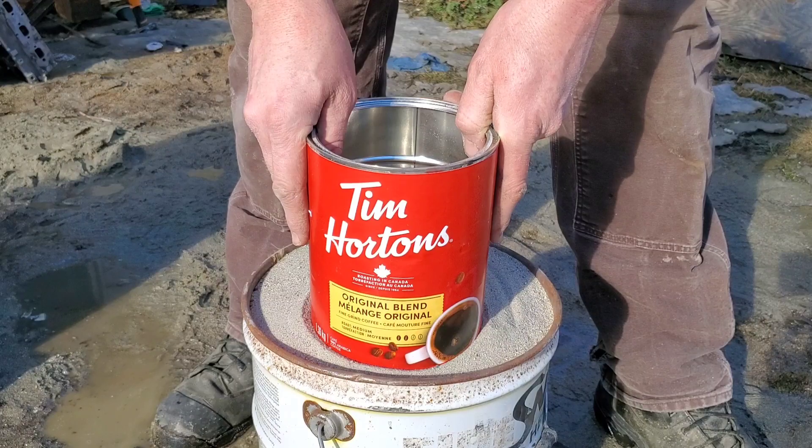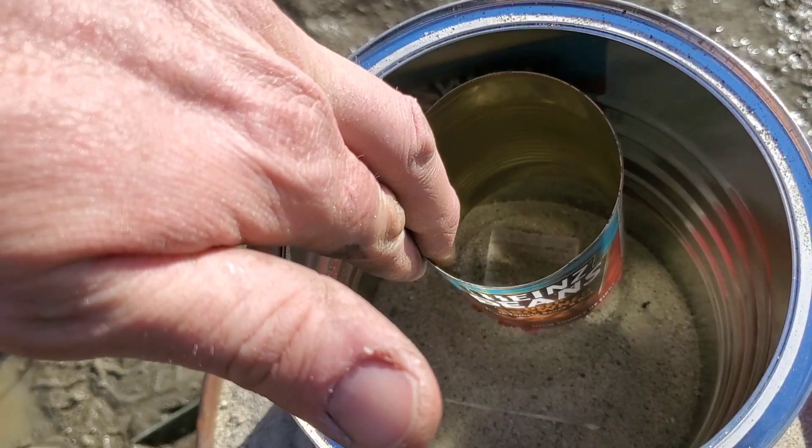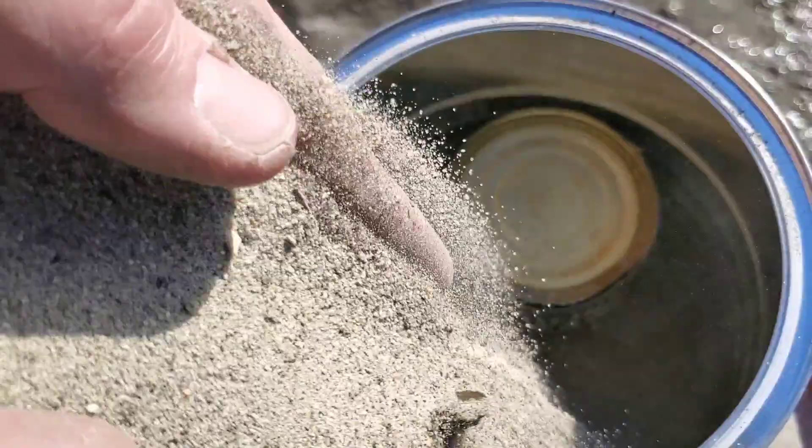Now for this casting the pail didn't quite fit the part I had to cast, so I had to come up with this little system. If you look down at the bottom of the screen you can actually see the foam sticking out, and this will need to be covered so I don't have a blowout and have to cut out the aluminum later.